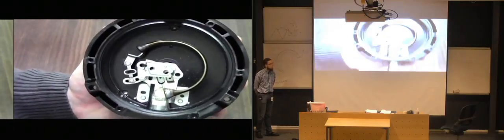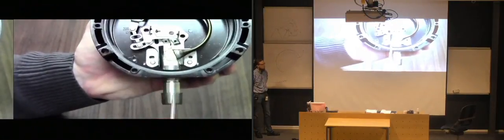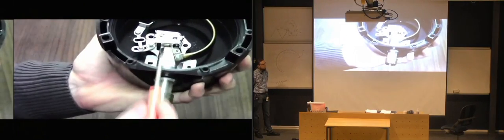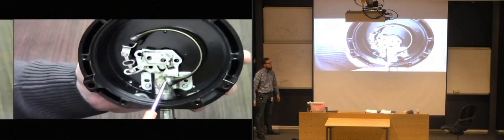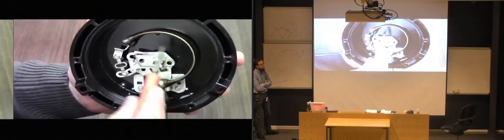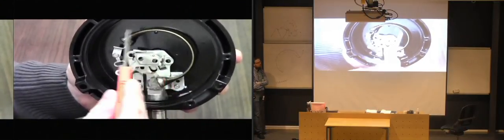So what are the parts? Well, first we're going to look at the socket connection. Okay, the socket and the connection are all one big piece of metal that's hollowed out, is where your orifice is that connects to the media. The socket is then welded to the second part, which is the Bourdon tube. The Bourdon tube is this C-shaped metal you see.